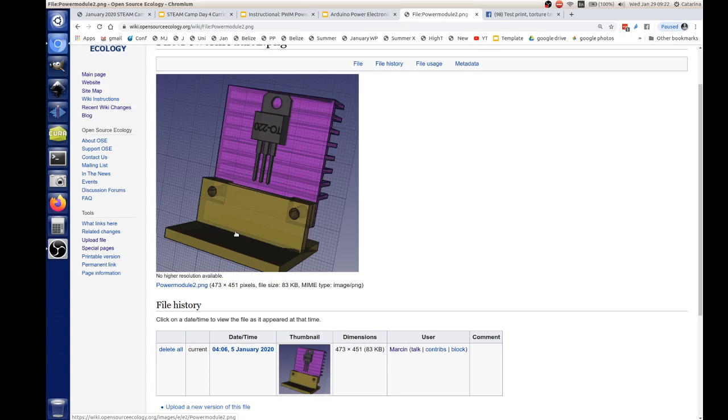600 watts. IGBT? Yeah. I think they said it could handle around 180. That's if it's pulsed, and with cooling. Excuse me, when I say 180, that's not watts, that's amps. 180 amps. Wow. Yeah. But practically, you'll see in your kits the IGBTs, the big power elements, the transistors, the three-legged little critters.